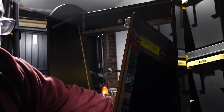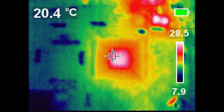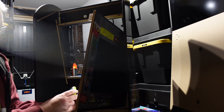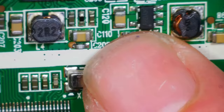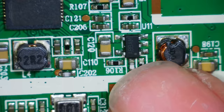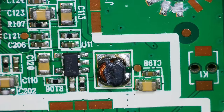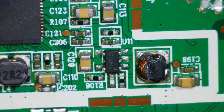I'm going to bring the thermal cam down to see if anything's getting hot on that board. You're not really going to see this, but I'll take a picture. Switch it on — got some heat coming from the main CPU and something else. 32 degrees, 33.4. Does that coil look a bit burnt? It does — I think this is where the heat was coming from.